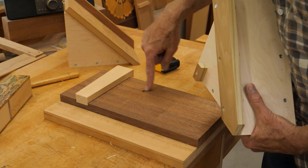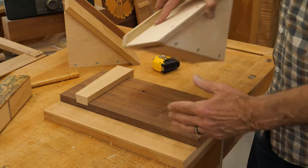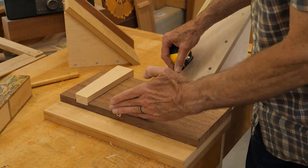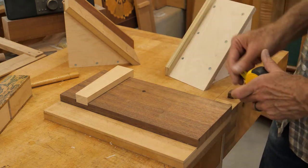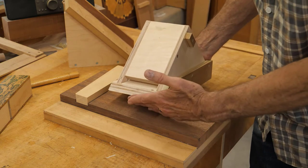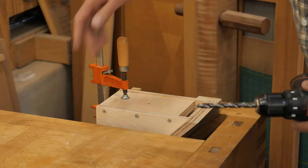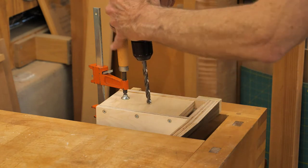I've got an insert which I just installed — I didn't have one on this shooting board. With this jig and my other miter jig, the best place to put the knob hole is five and a quarter inches from the reference edge and three and a quarter from the fence. Now that it's all together, I'll measure those same dimensions and drill a hole to attach this to the shooting board. I've got a piece of wood clamped inside to prevent tear-out when I drill through.